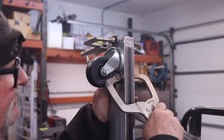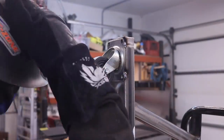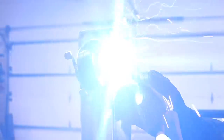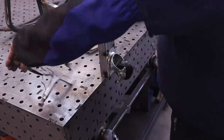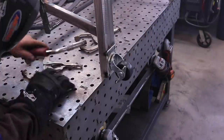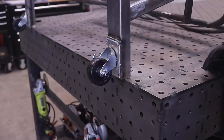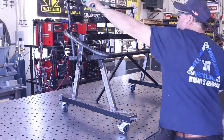One of the last things I had to do was install these casters. I got them at my local metal supply store — a lot of thought went into this. I wanted something durable that would last long and support some weight, so these are some really hard rubber casters. The metal supply store said these will last a long time, good quality rubber. The caster bracket thickness is about 14 gauge, which is pretty thin welding up to the eighth-inch thick wall stuff — a little bit of a challenge, but I got everything all filled in and it worked out pretty good.